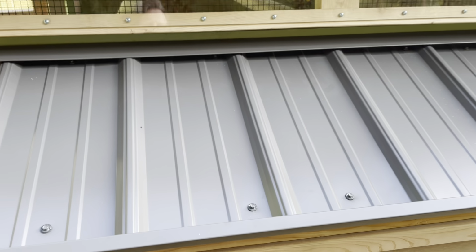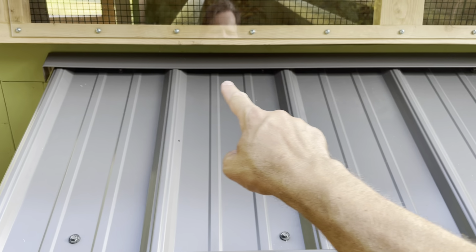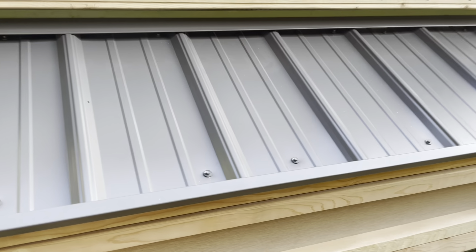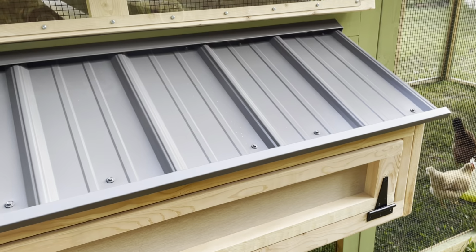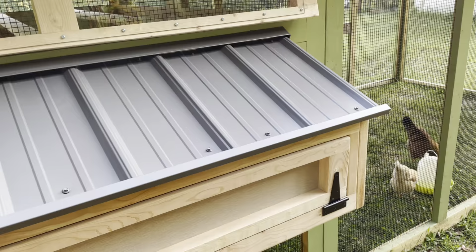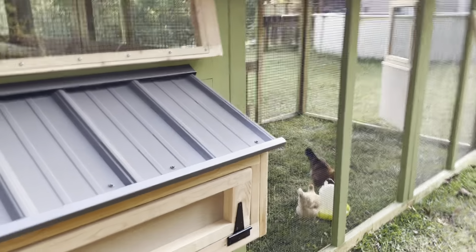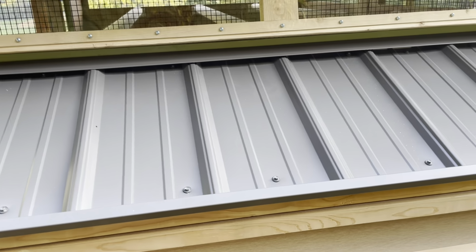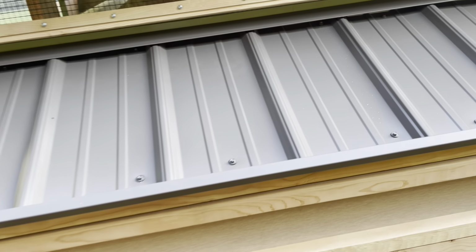The other thing that was a problem is the 206s. Between the overhang and what's needed for the roof, you need 18, and we only had 14. I happen to have a few extra. I had 1 extra from the roof, and actually 3 technically, and I took 2 off the roof on that end to help make sure it doesn't flap in the wind, because we get a lot of wind from that direction. So we'll see. There's actually 1 up in there that's not attached, and it's where these 2 are overlapped. And I did not pre-drill the holes.